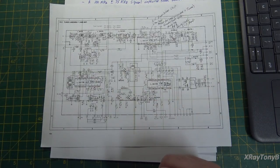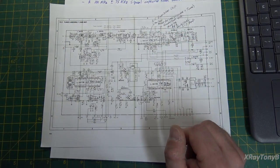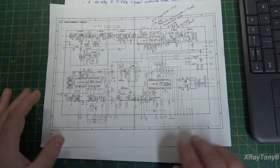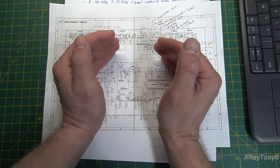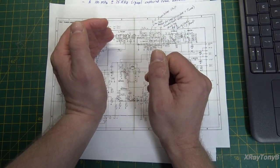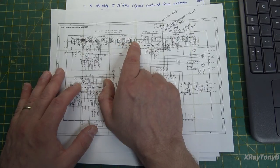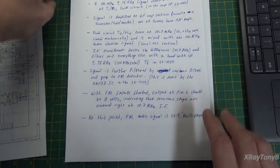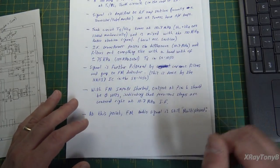Narrowing the filter makes the tuner harder to tune and starts clipping off part of your stereo — especially stereo multiplex and SCA signals. They make 100, 120, and 150 kilohertz filters. The SX-1050 uses 150 kilohertz filtering, plus and minus 75. The whole purpose of these filters is to narrow the 10.7 megahertz signal so only the multiplexed audio gets through. The 10.7 is filtered multiple times and amplified, and when it comes out it's an intermediate frequency centered at 10.7 megahertz with your original audio riding on it.